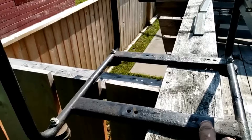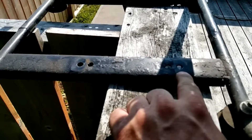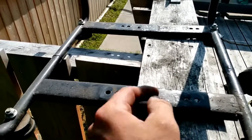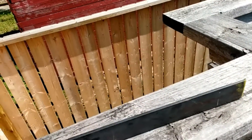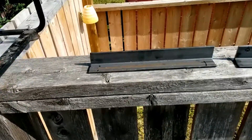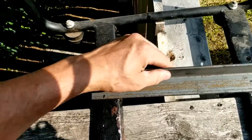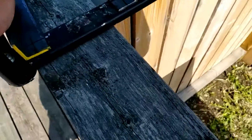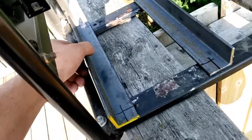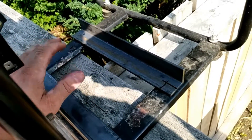Just one of these two lines up with this one over here. I don't have any bolt holes that technically line up — this one here lines up. So I'm pretty sure it's this one here; it's gonna sort of line up with this one on the outside because it's different from the engine into the generator. So you can see these are the two pieces cut off — this is for the faceplate side and this is for the backside. You're gonna see pretty much like that, and that's just gonna line up and I'm gonna bolt that on top. The generator will sit there — I don't care if it's on an angle a bit, it doesn't matter because I can weld it afterwards.